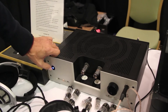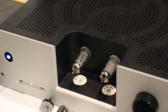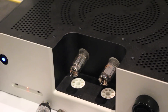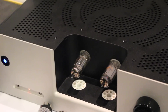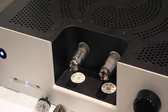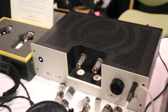We'll just fire it up and it'll come right up. It has the classic Cavalli Audio heater warmup delay — you'll see that it won't apply the high voltages to the tubes until the heaters are warmed up. Then it has the offset delay detection system, so it waits until all the DC at the output settles before it connects the headphones. It's just about through its cycle and in another 15 seconds it'll be ready to go.